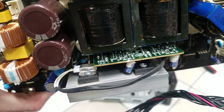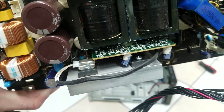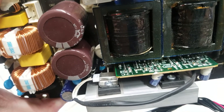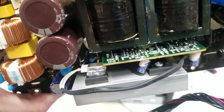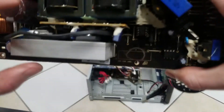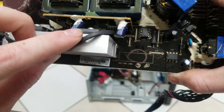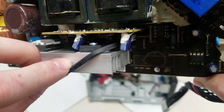Let's see if I can give you a close-up of where those capacitors are going to be. Here, you can kind of see one right down in there. You can't really see it on camera, but it's more of a greenish color rather than a blue — it should be blue. And then there is another one down in front of this MOSFET, but the camera won't quite pick it up.